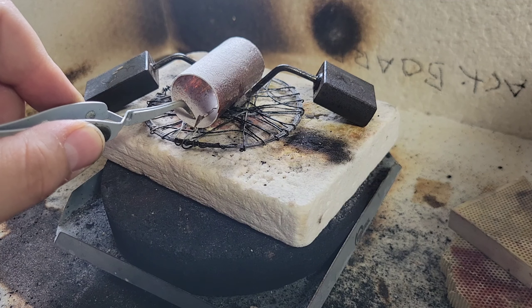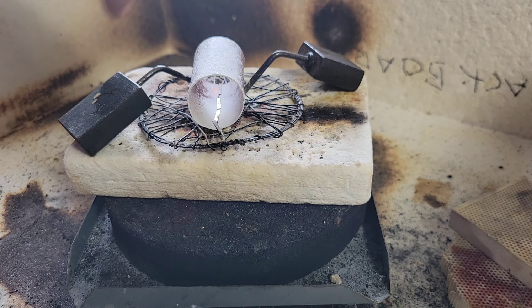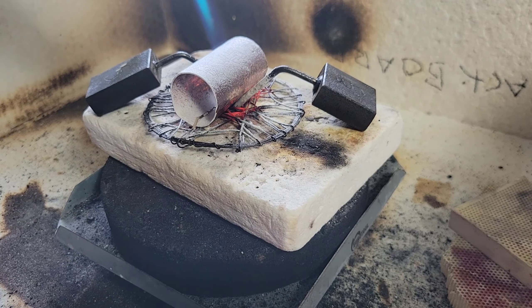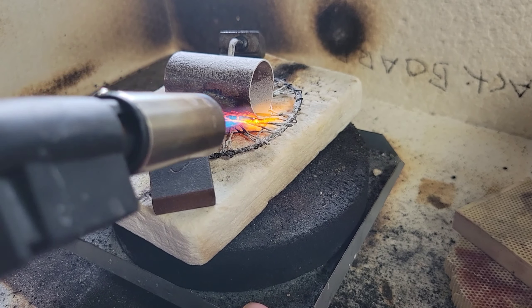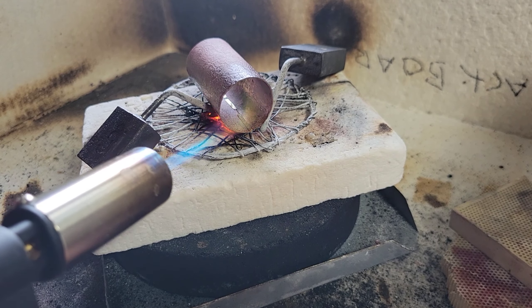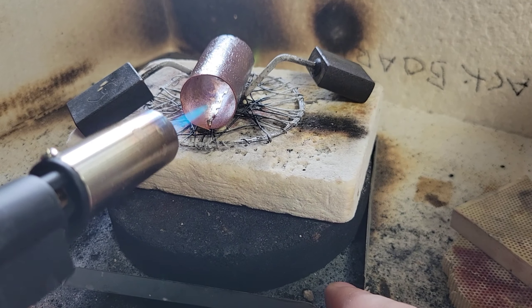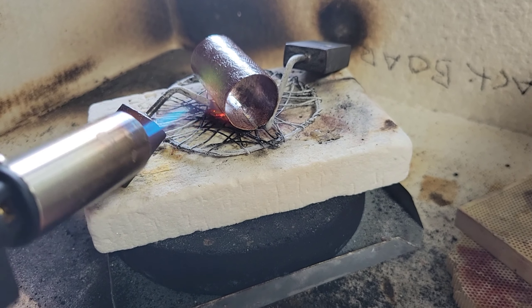Once we place them adequately, we're just going to start heating up the entire body again. It's tough with large hands, let me tell you. We're going to overall heat everything, then start focusing on the bottom and the interior — trying not to put a direct flame on the silver solder in this early stage, because it just will not melt. We need an overall heating. The lazy Susan is great for that, as are the hummingbirds, because they keep it in place and we just spin it and spin it and torch it and torch it. You'll notice the flame coming off the copper is green — super cool — it gets a really neat luster. It looks a little wet, and that's just before cherry red and annealing.